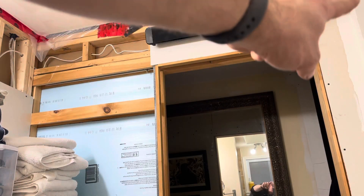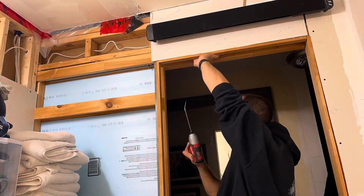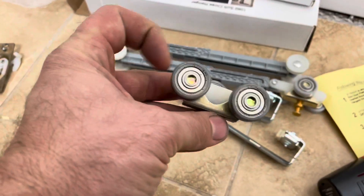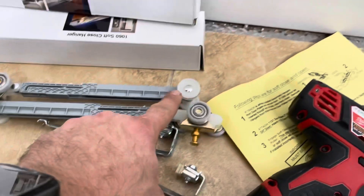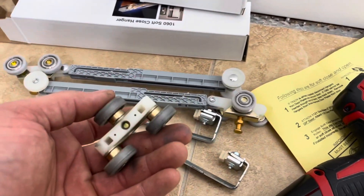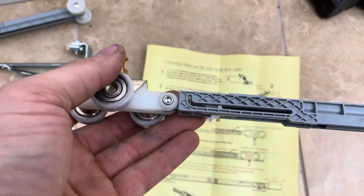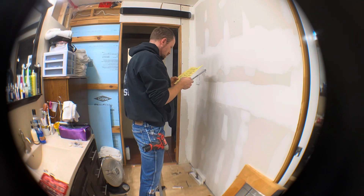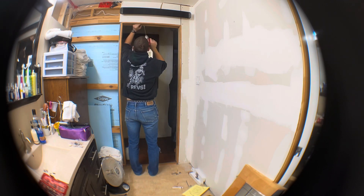The next step is to remove that channel. This part of the job might be impossible for you, because you'll have to cut the drywall to get access to it. I haven't put mine up, so I have easy access. I actually upgraded mine to bearings — I thought they were nylon only, which would be this here, and they do settle like that. Now to install these — they go in a certain way, make sure you read the instructions. Make sure that your hanger is engaged for the closing side as per the instructions. It's both the closing and open side that have the hanger engaged, so that when everything gets up in place it immediately will work. Otherwise you'll have to bring it back down. This was a hard sell, but I got it to work.